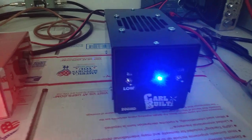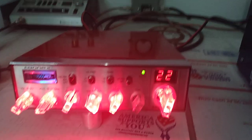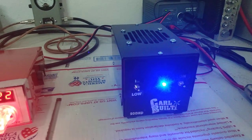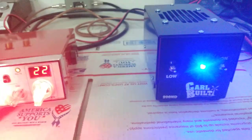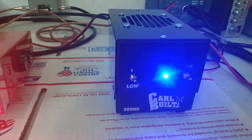2-pill 2879 standard. We're going to hit it with 3 watts dead key, 50 watts worth of swing or PEP, with 20 watts worth of average power swing going into it. That's about what I recommend on these. You can go up to about 60 or so, probably tops. But I recommend 50 watts worth of swing going in. Again, 20, 25 watts average, and 3-4 watt dead key, something like that.